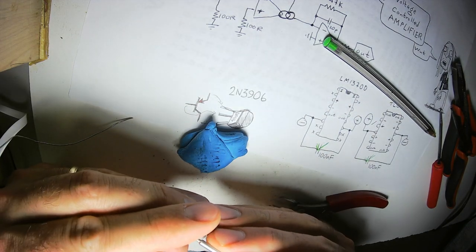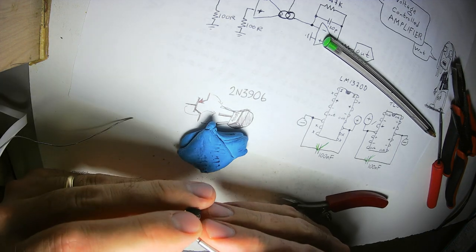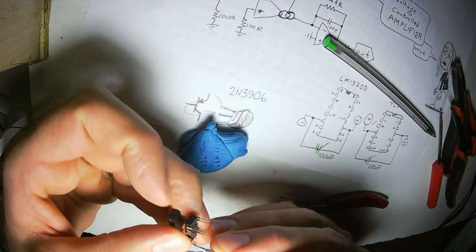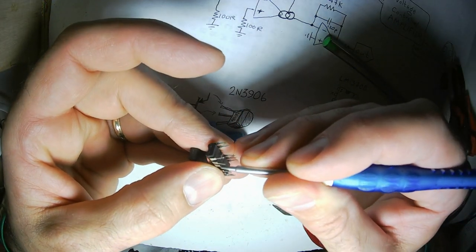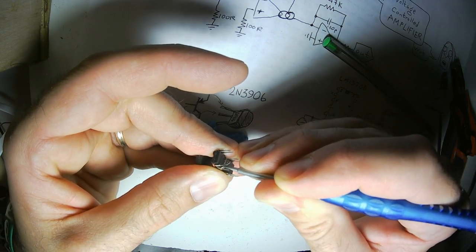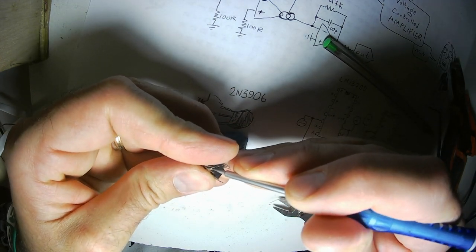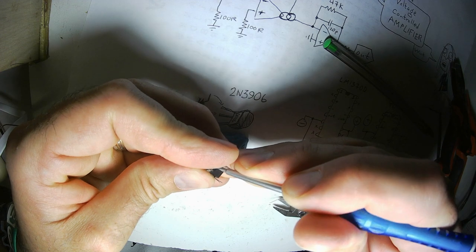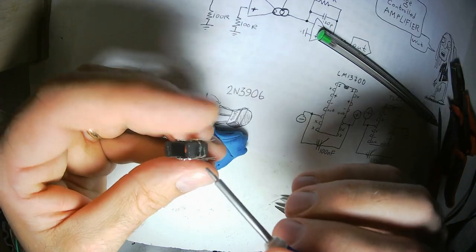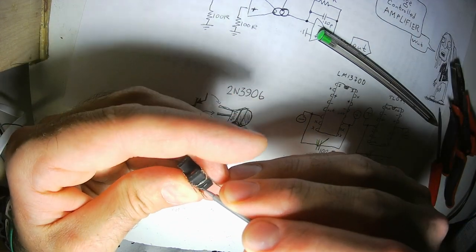especially some of the CMOS chips that are common in synthesizers have switching going on inside of them that is very fast and very abrupt. And that fast switching can cause noise to creep out of the chip into the rest of the circuit. Anyway, the capacitor will get rid of all that noise.